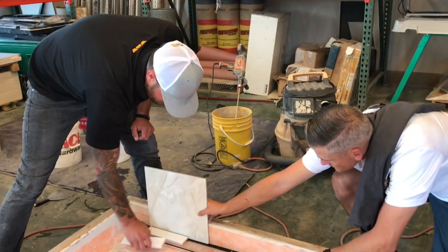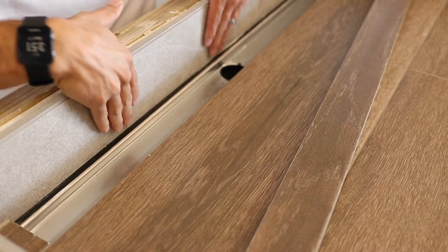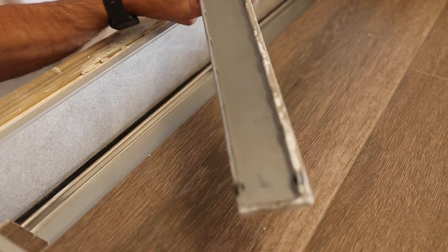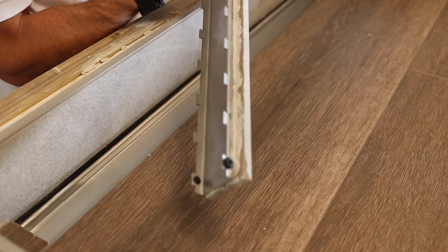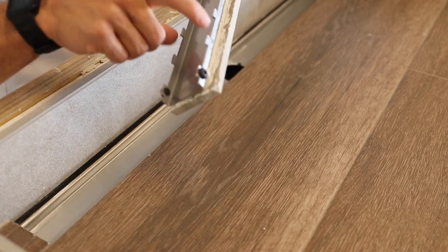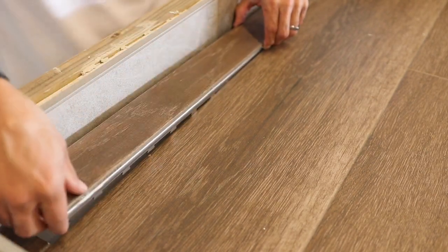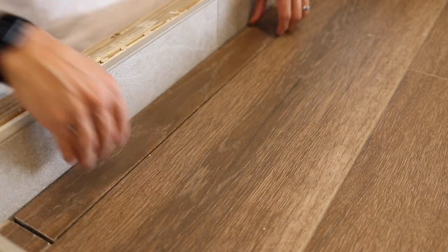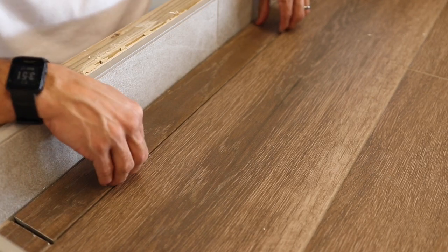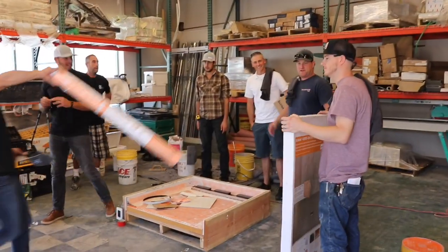It looks really clean. So the rubber piece goes in here, and the wall tile sits directly on that. Then our drain top — you can see how we have the tile cantilevered over the edge there, sticking out maybe three-eighths of an inch, so that when we put the drain in here, it sits up against the wall. Then there's just a gap for the water to drain instead of having a small cut piece of tile there. That's what Eddie was showing — explaining what that piece of black rubber was for.